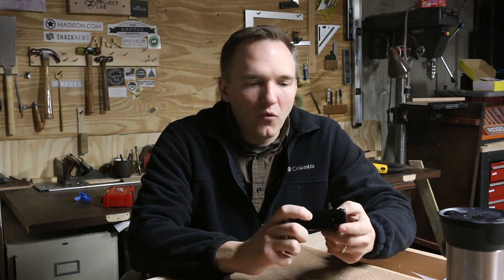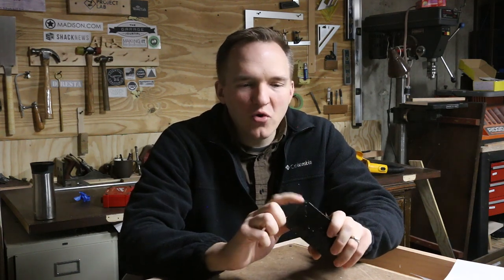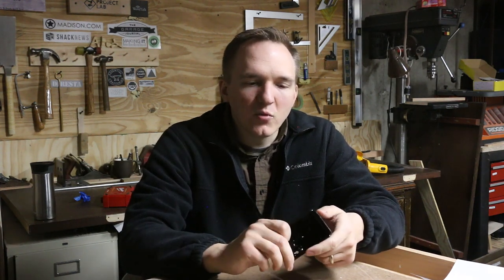I really think most of the problems here were because of fitment. I just don't really have a great setup yet for cutting metal. I was also trying to do some bevels on the edges so that the puddle would sink into those spots and it would create a stronger joint, but there just wasn't enough metal left. I beveled it too much and the weld just blew right through. I also didn't mean to break the corners, obviously. Maybe if I would have heated up the metal and bent it that way instead, it wouldn't have broken.